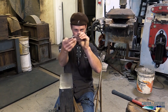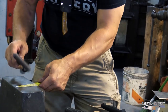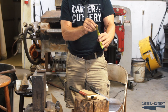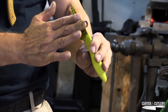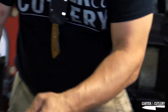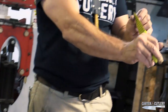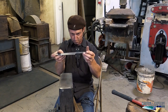This small knife has a curve in it, so I put the curve up on the anvil and give it a few blows, then check it in natural light. I've straightened this section pretty well, but there's still a little curve right here — so very lightly, one last blow, and there it is: that's straight.